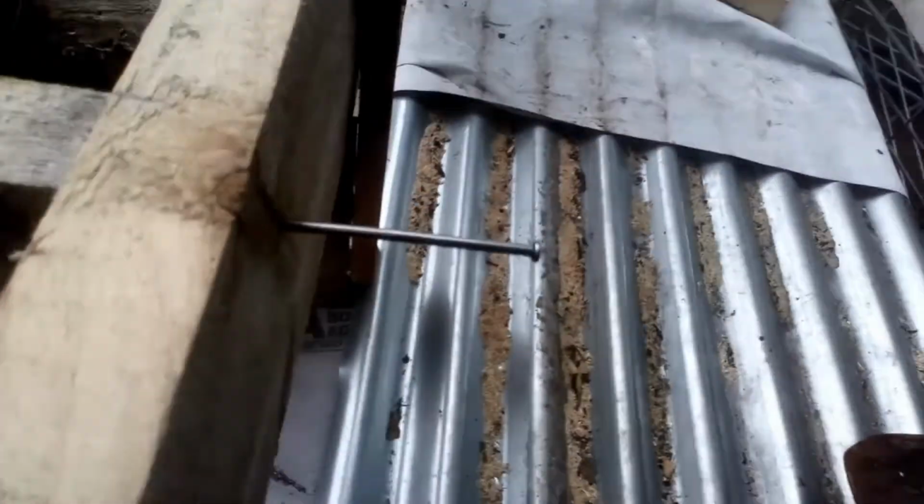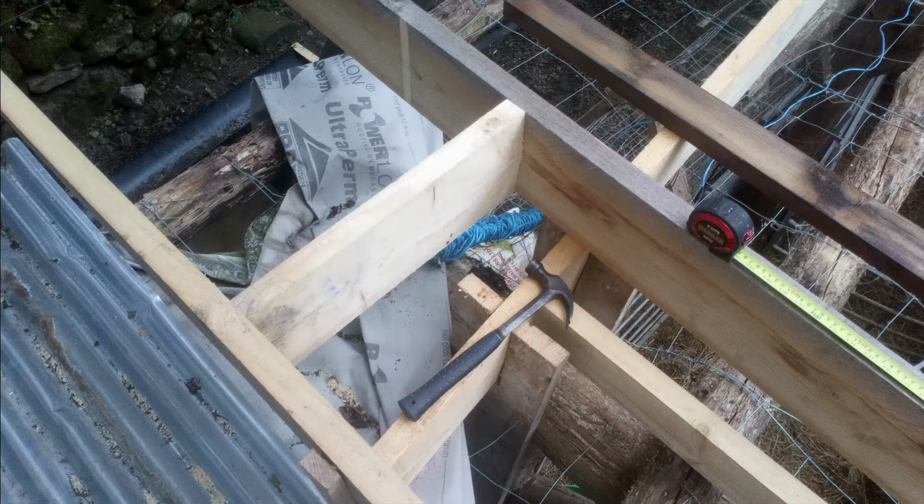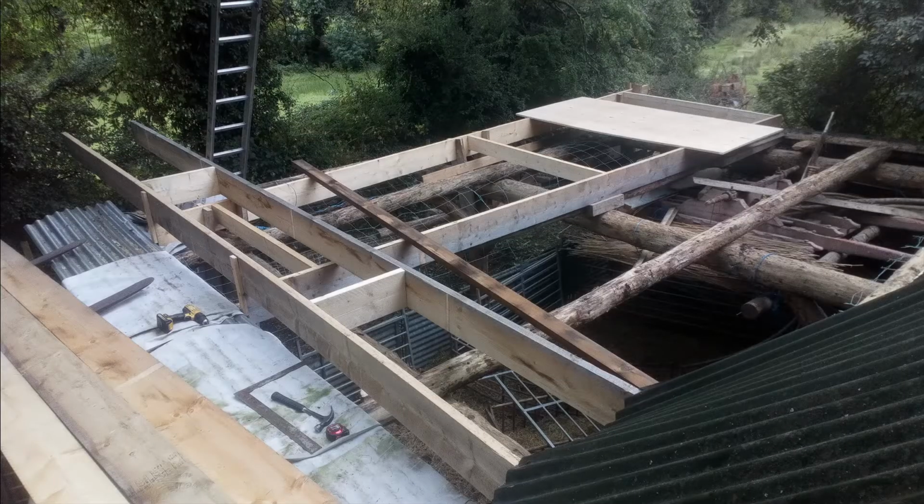And we can hammer in our first nails here for our first noggin. And just a second nail on the bottom there just for extra support. And that's that nailed in from both sides. And you can see then we do again with the other side as well. And that's like 2 of the joists in. And we got to do that a ton more.